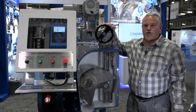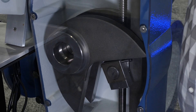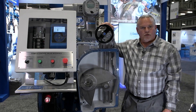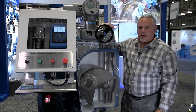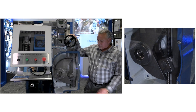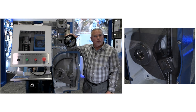The most important feature of the CPC SmartCheck is it will fail close on loss of power. As you see in the video, the valve is in the open position and the motor is also in the open position. If the pump was running and we lost power to the pump, we also lose power to the electric motor actuator. However, with the unique assembly of the yoke mechanism, the yoke nut is not connected to the yoke. So as I simulate a power failure, you can see the yoke rotates and the check valve closes like a standard lever and weight air cushion swing check valve, even though the motor is still in the open position.